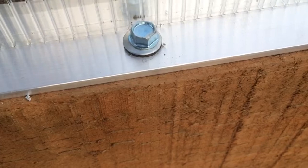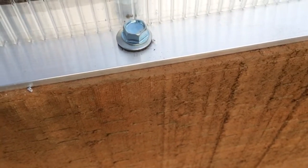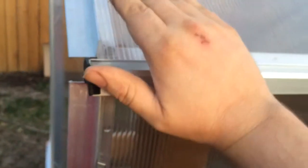I was really worried about it last night around 11:30 — I was out here working on it, and that's what the lights are all about. I was wrapping up and thought, 'There's nothing holding this thing to the foundation.' So I went and got some self-tapping screws with little rubber washers at the bottom and used those to bolt it down, otherwise you could just pick the whole thing up. I've had pop-up canopies blow into the neighbor's yard a couple times, so I didn't want that happening again.